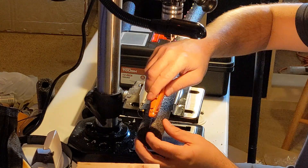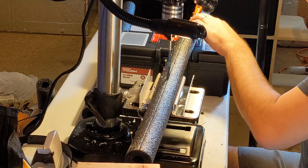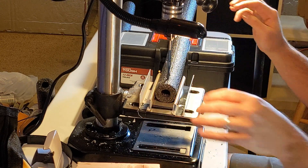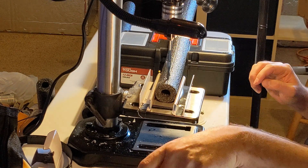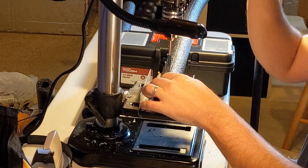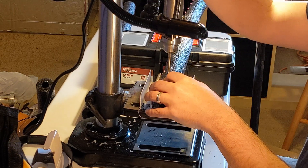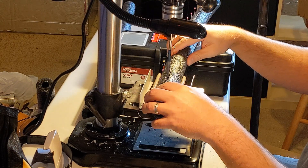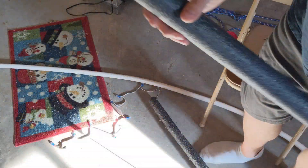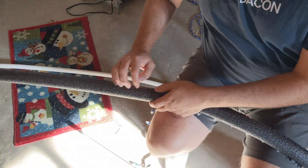Now that we've marked where we want to drill the holes, use a knife or box cutter to cut open the insulation on the factory edge. With the cut edge facing up, drill the hole at the marked location completely through the tube. By using the factory edge as a guide, we keep our pixels along a straight line without skewing up or down. Once the holes are drilled, push the pixels through the slit in the back into the holes — that slit makes it easier to keep the wires concealed.